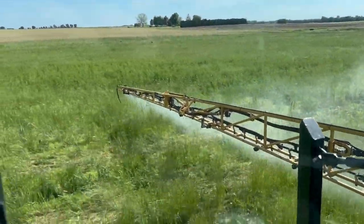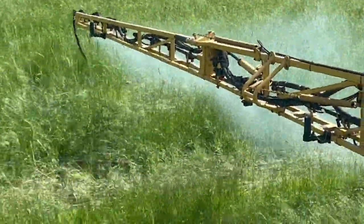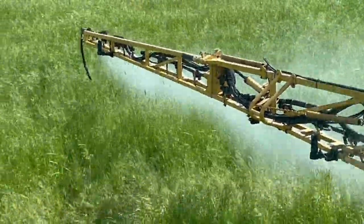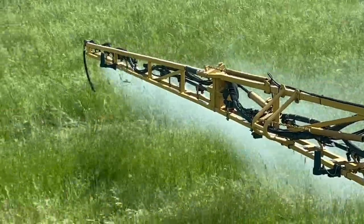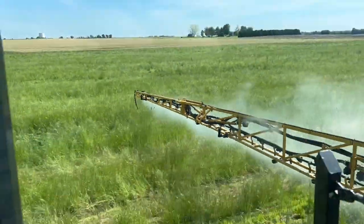We'll see what it does on some of these grasses and the rye. For now we're spraying right along at 30 gallons to the acre. We're not moving real fast — we're at that high volume. We want good coverage so we're only running about eight to nine miles an hour. We've got about 18 acres left in this field, we're getting there. When I go by, everything behind me is absolutely soaked, so we're getting good coverage.